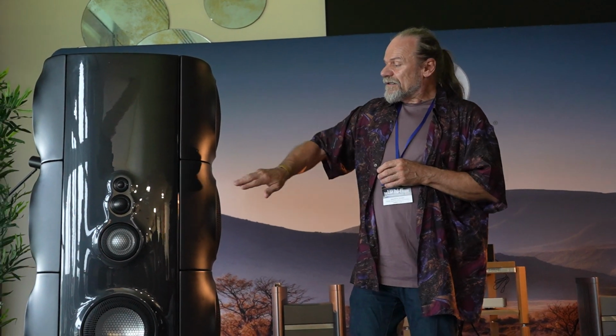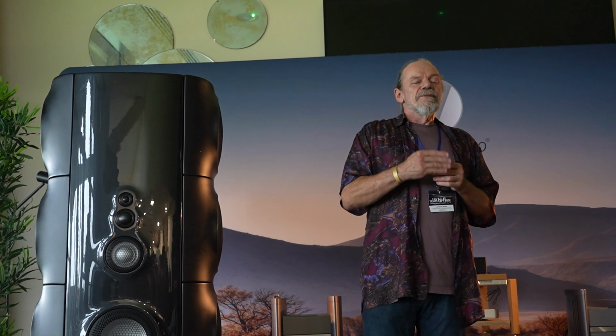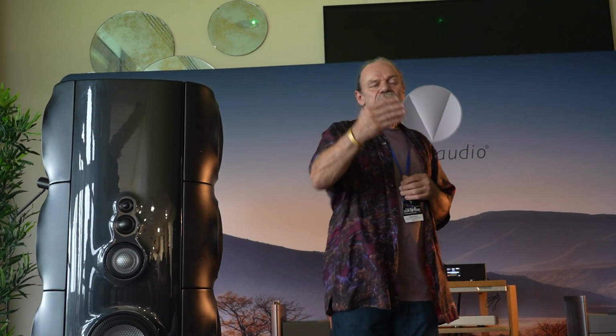If we look at the loudspeaker, it has this moving diaphragm which actually creates the sound. It moves back and forth, and you get sound on both sides in opposite phase, equal and opposite. But the first element in this, the actual diaphragm, in my opinion, needs to be completely free of resonance. That means, in practice, that its first breakup mode has to be out of band, beyond the highest frequency that's going to be demanded of it or that you can hear.